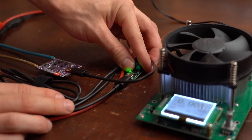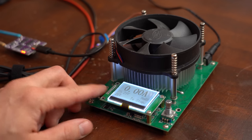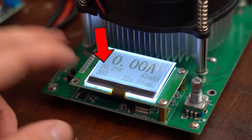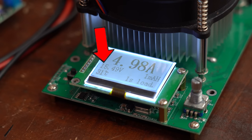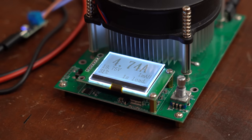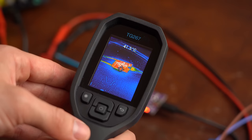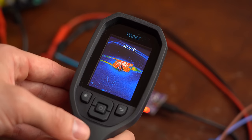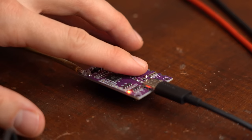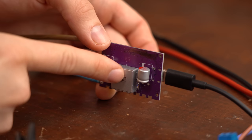Next I did the 100W power test with a constant load, and it turns out the output voltage drops a bit too much while drawing 5A. At 4.6A however the voltage is still acceptable, and 90W of power is still pretty good for such a board that doesn't even get hot while pushing that much power — I could touch all the components without getting burned and no additional cooling is needed.